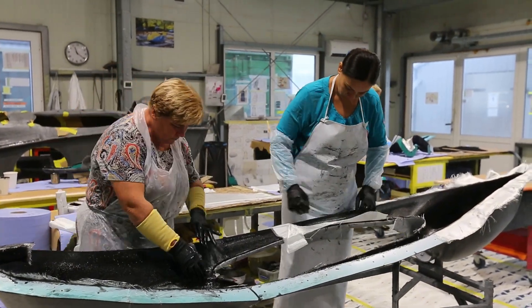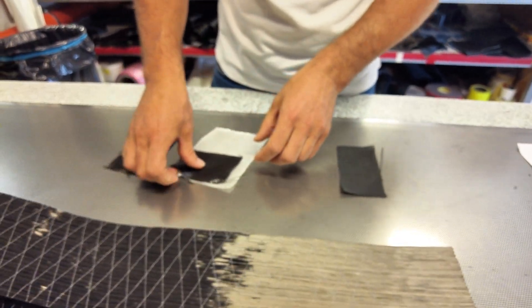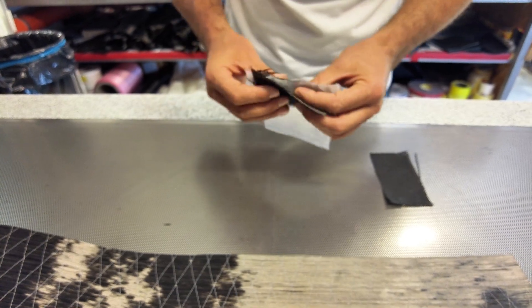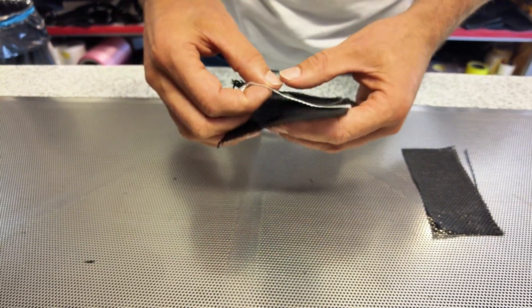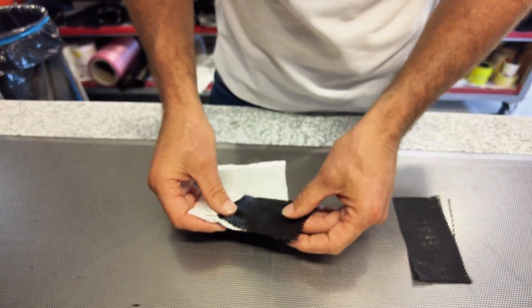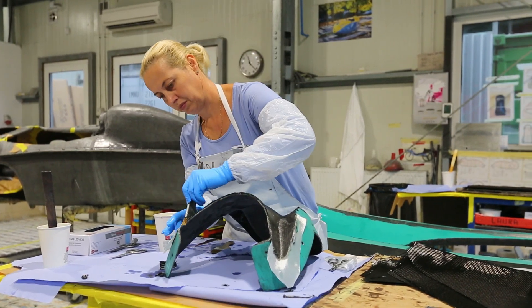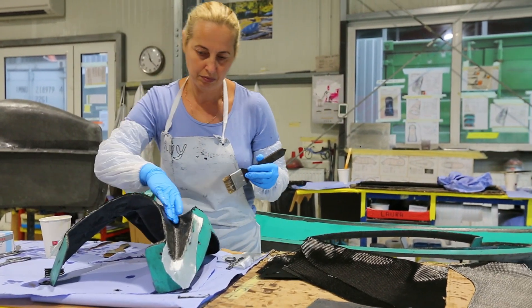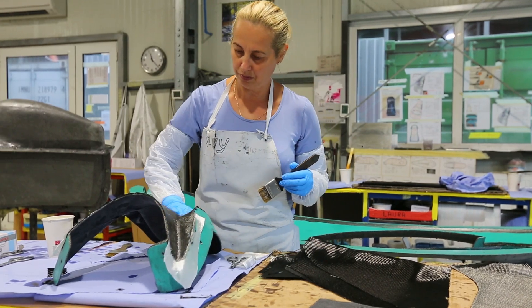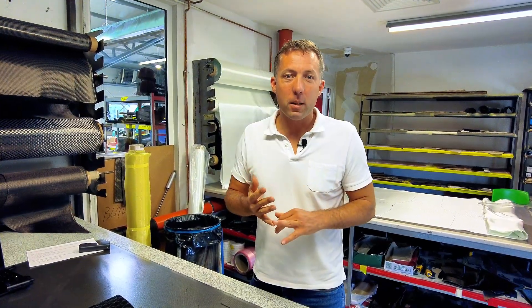From our experience in practice, we combine carbon fiber with Innegra in multiple places. This allows us to increase the stiffness of the bike, increase the impact resistance, and reduce noise and heat transfer. We layer the two materials together in a composite sandwich: the outside first layer is carbon fiber, then an Innegra layer, then carbon fiber again. The result is a light, strong, and fast velomobile.